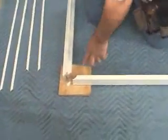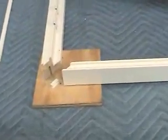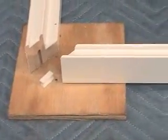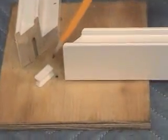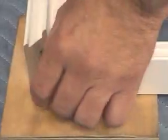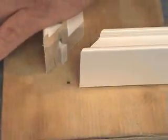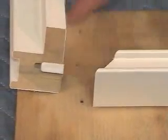Let's begin by placing a hard flat surface like this plywood on the floor. This allows the Hoffman key to be placed inside the Hoffman keyway easily and flush. Note that the Hoffman key has a flat end and a round end. The round end will be placed inside the frame and the flat end will be laid on the hard surface. Go ahead and insert the Hoffman key and simply press down. This will allow you to have a nice flush surface on the back side of the frame.